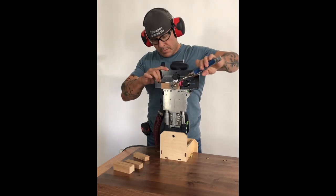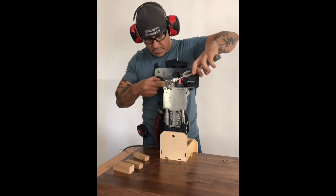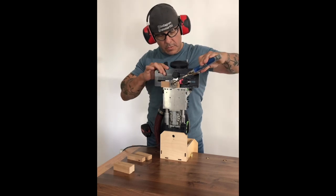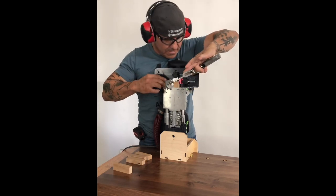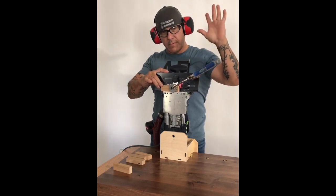I'm utilizing the XL plate by Seneca Woodworking, which also has accommodations for this AutoMax clamp, and you can see it just holds those small pieces nice and safe. I can just make those plunge cuts. Super easy, very effective, safe — look, one hand.